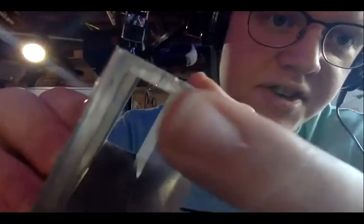So I'm not sure how obvious it is to you guys, but you can see that this side is pretty shiny. It's almost a mirror. And this side is a little bit more rough, simply the bandsaw cuts and everything. We would prefer this side to this side in pretty much every situation in terms of fabricating a robot. So climbing cuts and falling cuts are something that you have to keep in mind. It becomes super intuitive after some practice with the tools. But yeah, that's all I wanted to say about that sort of process.